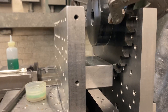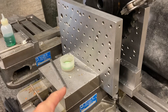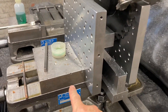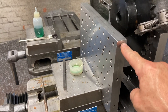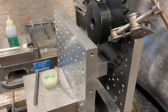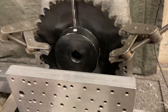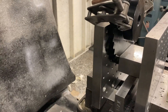You really can't close the vise jaw all the way and grab and pinch against this, because the pressure is way up here and the jaw is doing its clamping way down here. The screw that's doing all the pressure is way down here, so when you're squeezing and trying to grab way up here it's really wanting to rack and tip that jaw — a very unhealthy setup. So I use that block just to put a little pressure on it, just close the vise to hold the sprocket in place, and then put the clamps and kant-twist clamps on to hold it nice and firm up against that back plate.